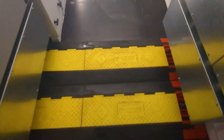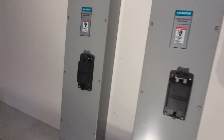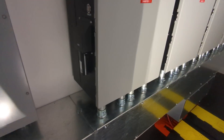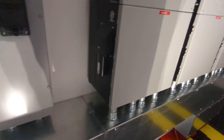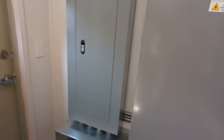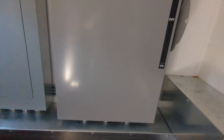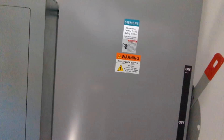The Uline trays work really well for the battery cable — there's a lot of battery cable in here combining all the batteries and getting them into the inverters. We added an extra gutter for wire management. Two enclosed circuit breakers for the grid coming in each hit a PDB that splits to three, which hits another PDB that splits to three, and then we have a combined load that transitions to this wiring trough out to the disconnect. There'll be loads like the home landed directly on the 400-amp disconnect outside, and of course we have our bypass — on/off/on, grid or load. This is a beast — gotta love a Siemens heavy-duty safety switch.